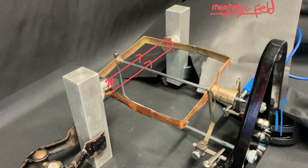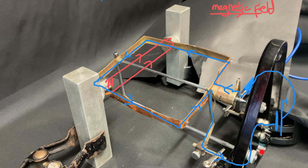Off the camera view I've got a power supply which is sending an electric current in through here, in through this brush, in through the commutator, into the coil, which is then going round the coil many times. I'm just going to draw the current going in once and then out through the commutator and this brush and back to the other terminal of the power supply.